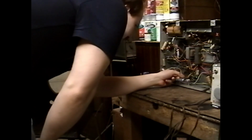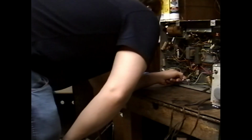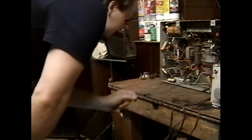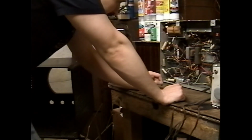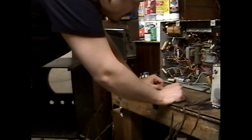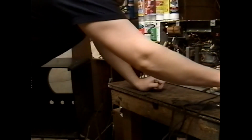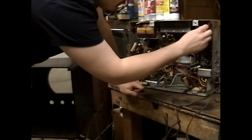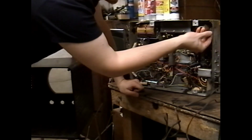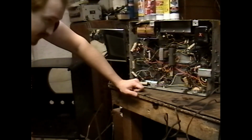Okay. Huh. So someone replaced the boost lytic on this once upon a time. And it looks like they replaced multiple others. Well, maybe that isn't the boost lytic. But they did definitely replace two different lytics on this can as individual sections. Wow. You can't see nothing, can you? There's a big glob of wax under the power transformer here, and it's in the bottom of the cabinet along the back.